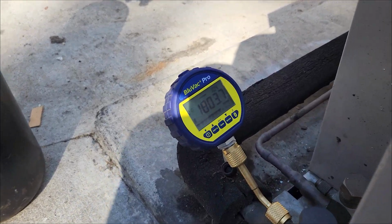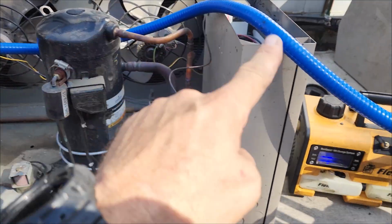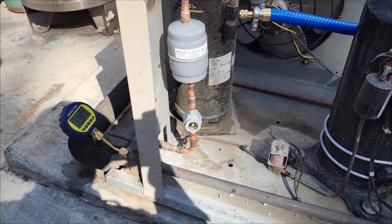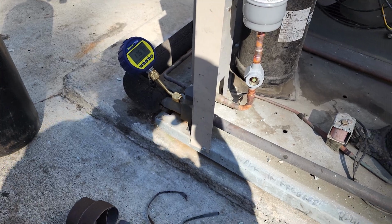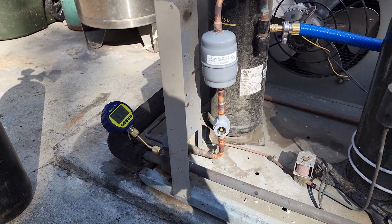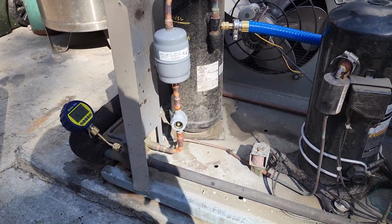Right now we're at about 1,800 microns. Once I get below 1,000, and this is a true vacuum, mind you, because it's pulling through here, okay? And once we see 1,000 microns, we'll shut the gas ballast and continue the evacuation. I went ahead and closed the gas ballast a little early. It's usually anywhere between 1,000 and 2,000 microns in my opinion, and I'm sure someone can correct me, but